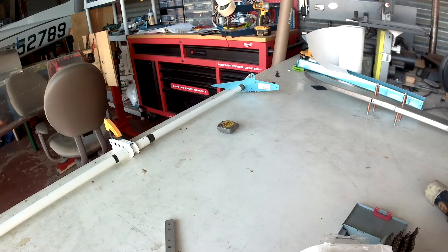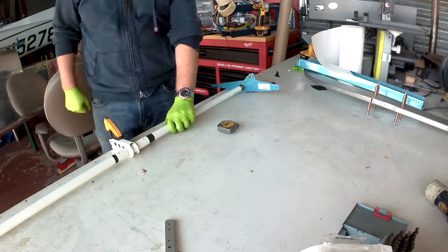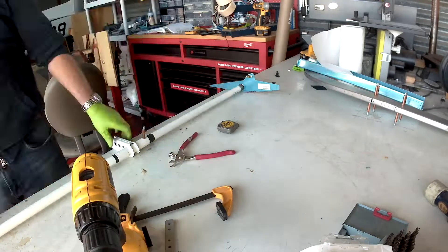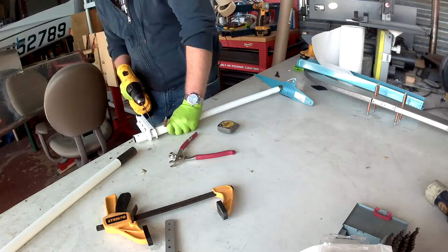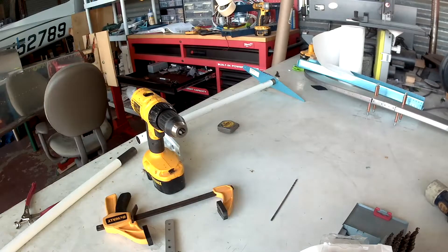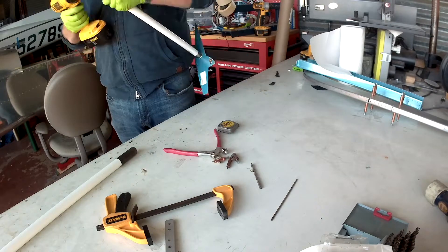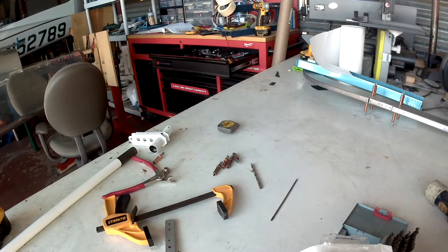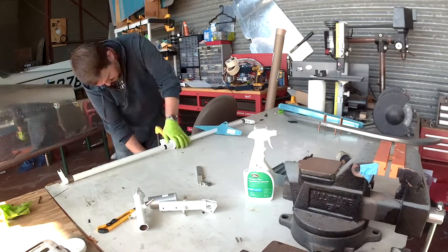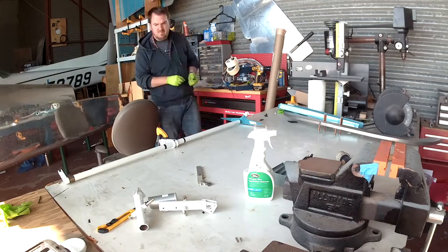Anyone that watched me build the wings might recognize that little blue piece of aluminum I've got attached to one of the sides of the flaps. That is a guide piece that Vans has engineered, and they use it for helping align the ailerons with the wing and all kinds of other stuff. This is just another one of those tools they've designed into it. So you lay it flat on the table, the flap arm will then mount straight into one of the holes with a bolt and some washers. And then you can match drill the center and Cleco together. All you really have to do is put that on, make sure it's square, make sure the bolt goes through the guide and the flap arm.